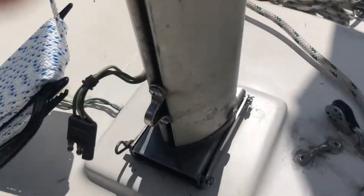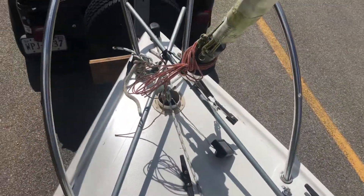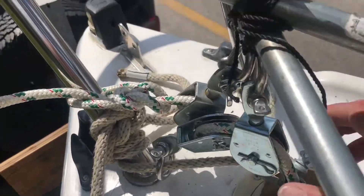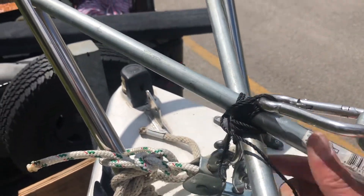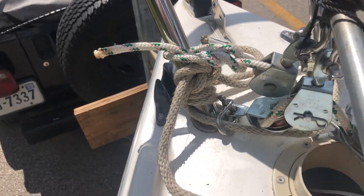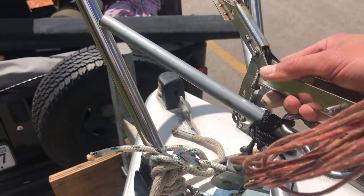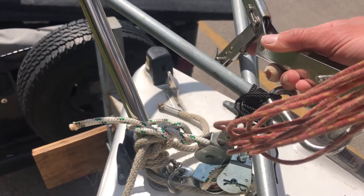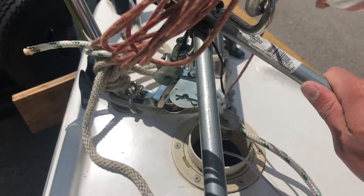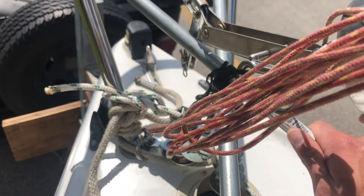I've pinned in my second pin on the mast. Here at the front there's a big jumble of pulleys — the two pulleys that are part of the A-frame and the two that are tied up to the bow. All I need to do now is take my furler jib and secure it to the chain plate in the front. Then this big mess will just basically sit here. I'll show you what it looks like once I get it rigged and neatened up a little bit — it doesn't really get in the way.